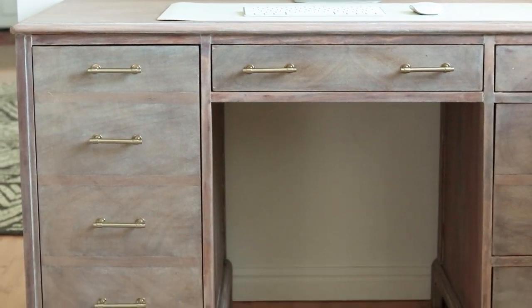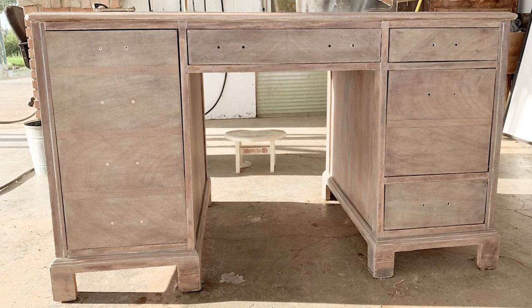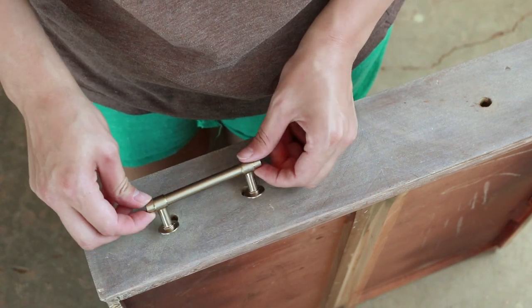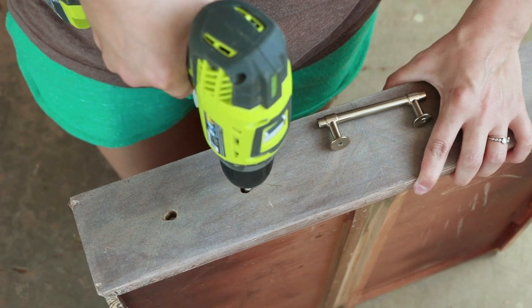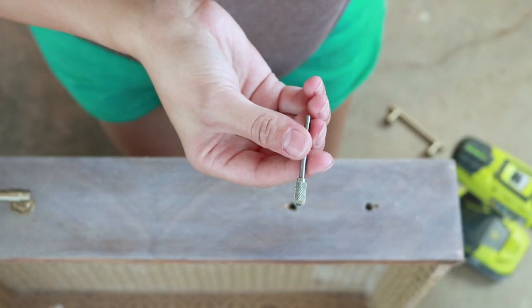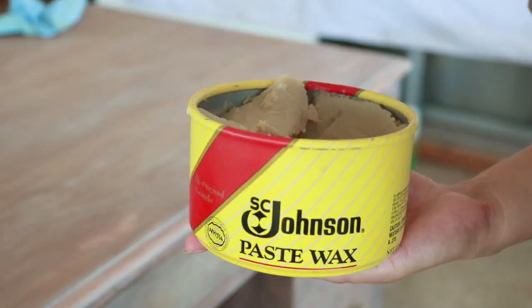Next I installed the hardware. I got it on Amazon — for all 10 handles I paid around $27, which is a steal compared to local hardware stores. The handles really made the desk look complete; without them it looked so sad. I'll add a link in the description. For some handles, the existing holes were smaller than the rest, so I widened those holes using a small tool from Tony's shop to sand the hole wider, and it worked perfectly.